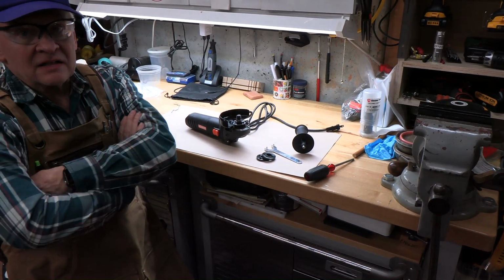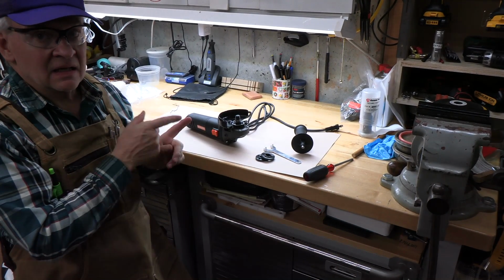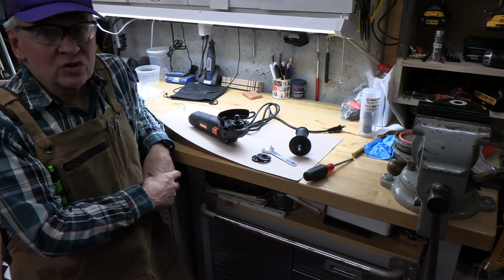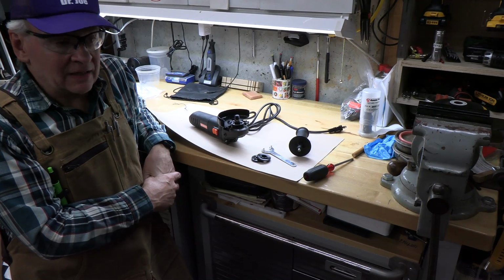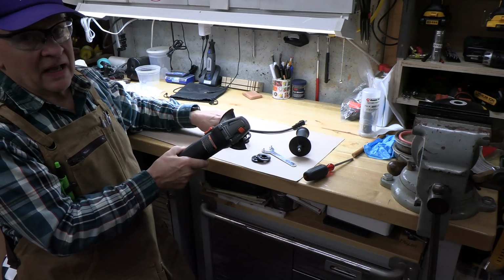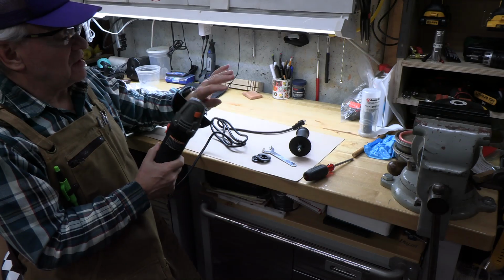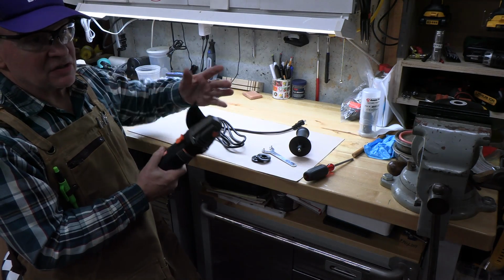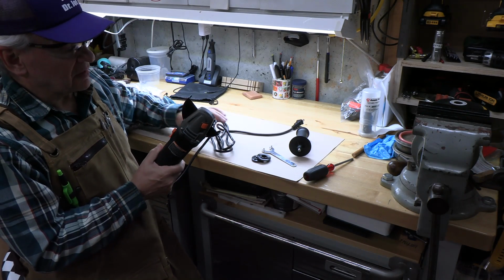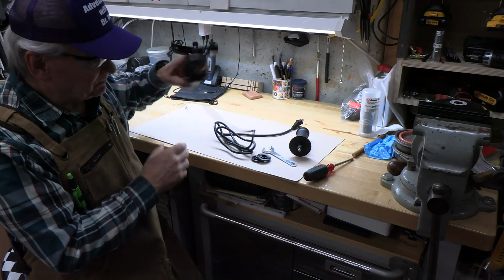When I first started my practice in plastic surgery, 90% of what I took care of was traumatic injuries of the hand, and the grinder was the most commonly involved tool to cause injury. People take their mind off it, they're not paying attention, they're holding on to it only with one hand, it gets kicked, it kicks back, gets into their hand, cuts their finger off, destroys their fingernail, cuts through their extensor tendon, other things. Very dangerous. Keep your eye on this tool. Even if it's a cheap tool, thinking, oh, no big deal. It's a big deal. This can hurt you very badly.